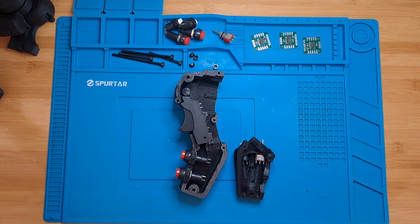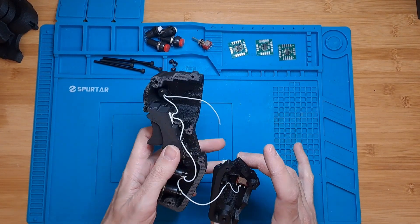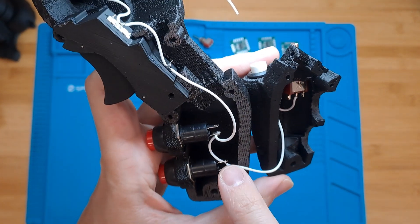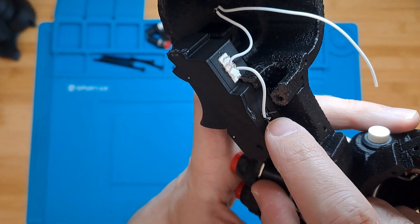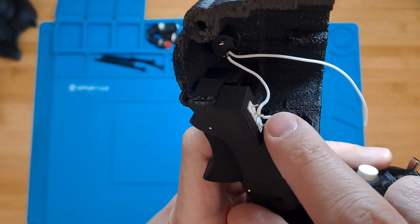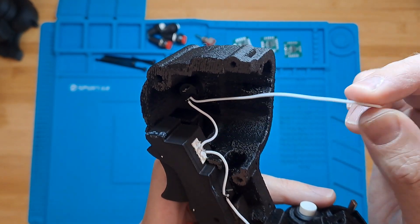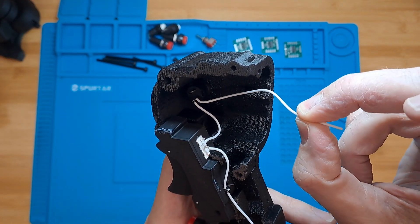By the magic of YouTube, here we are back. I started at the center pin, then went to one leg of the next button, one leg of the second-stage trigger assembly's six-by-six button, the middle leg of the limit switch, and one leg of the last button. I've left myself a little bit of wire but not too much, because this is going to be attached to the shift register, which is very small.